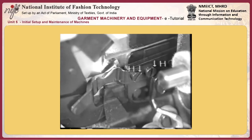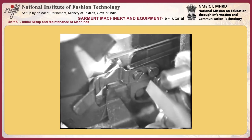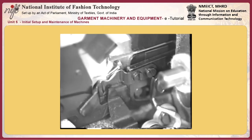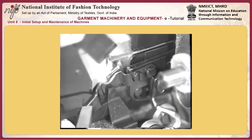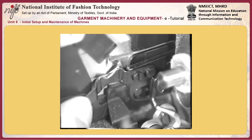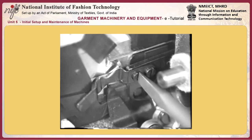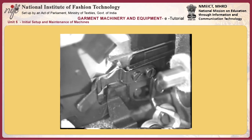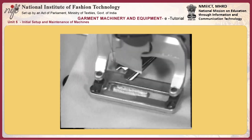24. Adjusting latch presser arm M. When lifting the work clamp foot, locking bracket latch C may come in contact with top end G of the presser arm to prevent the needle thread trimmer from reaching its leftmost position, thereby causing the needle thread trimmer to hit against the needle tip. The latch presser arm works to relieve the needle thread trimmer to the left when lifting the work clamp foot to avoid contact between the needle thread trimmer and the needle.